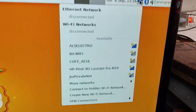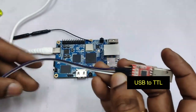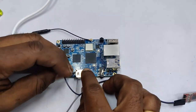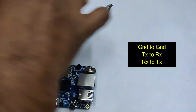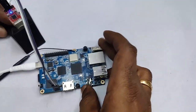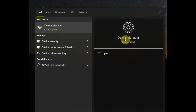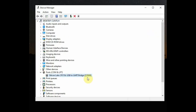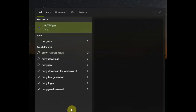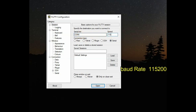Next we will see how to debug using the debug port and the command line interface. For this you need a USB-to-TTL device like this one — this USB-to-TTL is built on CP2102. Connect Ground to Ground, RX to TX, and TX to RX — reverse connection — only three connections, no power. Connect the USB-to-TTL to the PC and then provide power to the Orange Pi. Open Device Manager to know the COM port allotted to the USB-to-TTL. You should have the CP2102 driver installed. Now let us use PuTTY — open PuTTY, select Serial, and select the COM port allotted to the USB-to-TTL board. The baud rate is 115200.